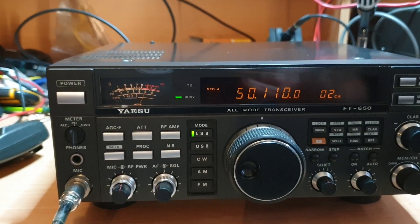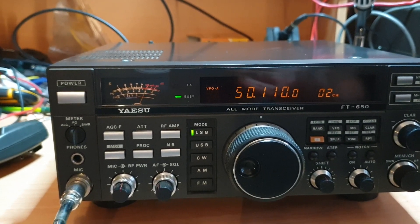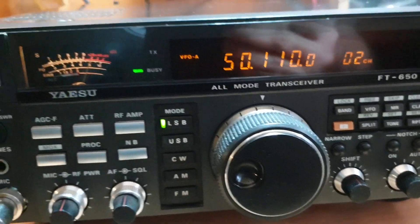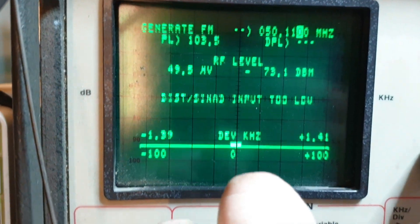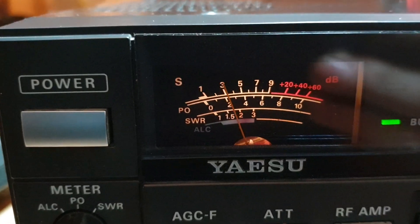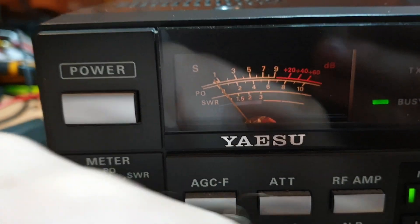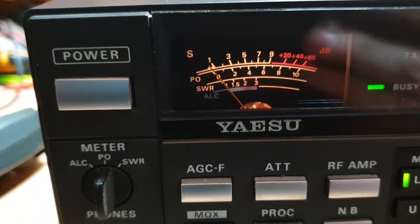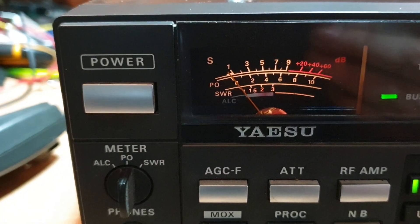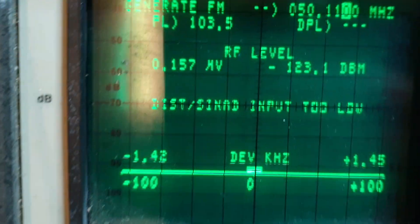I've got a 50 microvolt signal at the moment, which the meter's reading a little higher than it should be. When we have a look at this tone, I've got 50 microvolts going in there and we're going to go down to 5 microvolts — this is where it gets interesting. At 1.57 microvolts, which is about what you'd expect. At 0.5 of a microvolt, still hearing it — no worries. 0.5 is the spec we like to see out of any receiver. And then down to 0.157 — at that level a lot of radios start to get to a point where you're almost wondering if you're imagining the noise. Well, you're not with this.